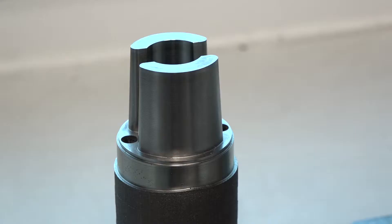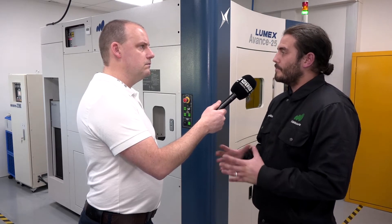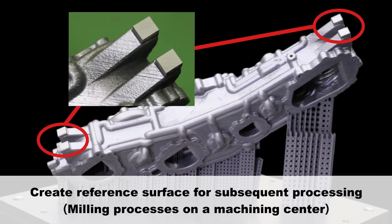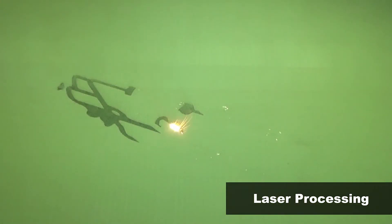A key advantage for tool makers is handling location points. Rather than taking a printed part off the machine and machining locations elsewhere, you can do it all in one hit. The machine can either machine the full component or just machine location points, so a part can be placed on a machining center afterward, probed accurately, and further machining carried on from there.